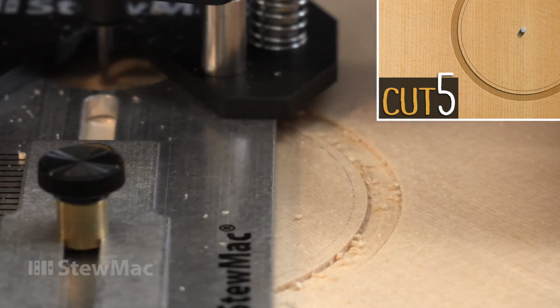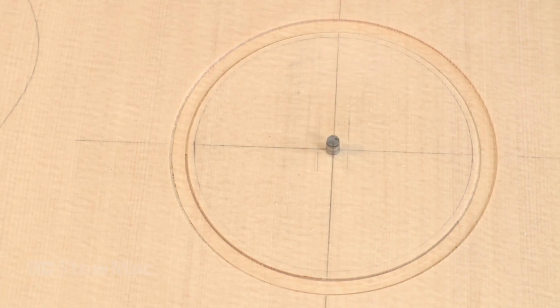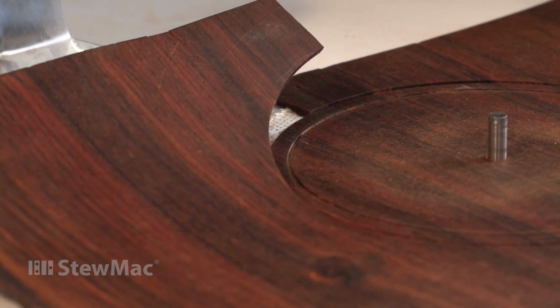Okay, and now we're just going to creep out till we run into the other purfling channel. Okay, and that's our channel. And now I have to very carefully remove the rosette ring.